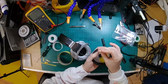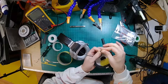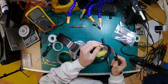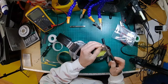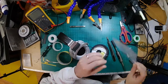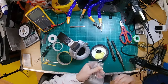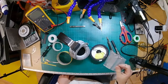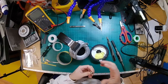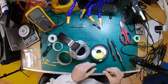Okay, so this is our headband cable. Just to be really confusing, in the Beyerdynamic factory, for the headband cable, they normally use the red for negative and the white for positive, which is deeply confusing because they do it the other way around on the rest of the cables. I don't know whether it's a language thing. Maybe if any of you speak German, let me know. Maybe the word for white corresponds to the word for red. For right. Oh, what am I on about? Yeah, where the white corresponds to right. They rhyme, but I don't know.